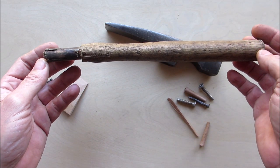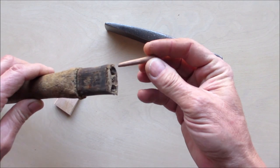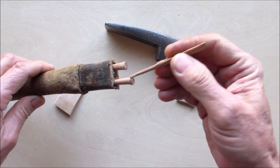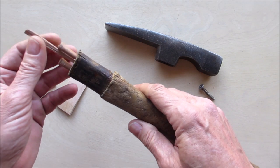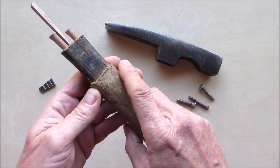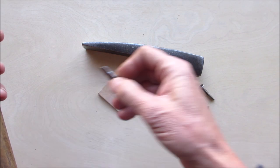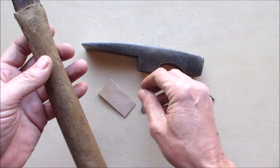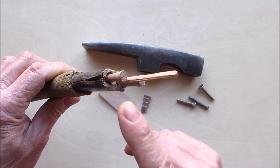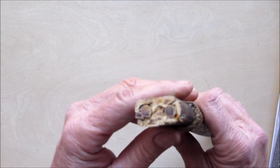For that reason I want to see if I can fix this. I don't know if it's going to work — I may have to end up putting a new handle on it, but I'm going to try. I've got some various little dowels that I whittled down. I'm going to glue these in, and after they're set up I'm going to take a rasp and try to reprofile it. I made a little maple wedge, and I have a steel wedge also. First thing is to just glue this in, then I'll bring you back.